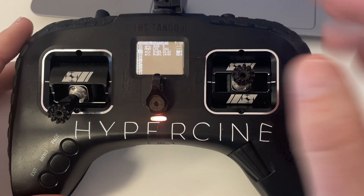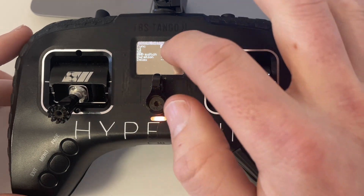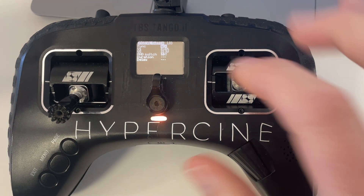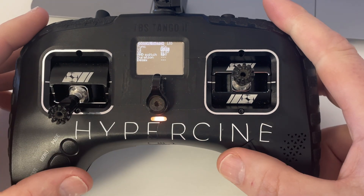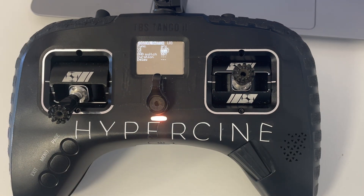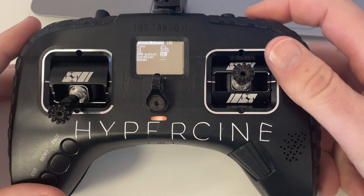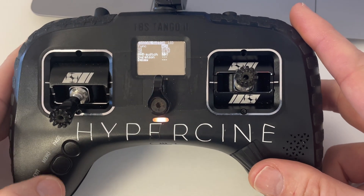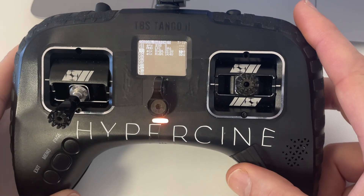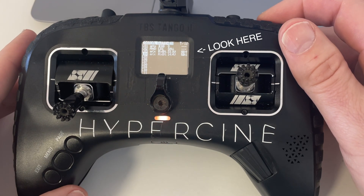To program this, go to L03 and do edit. Here you put: A is less than X, on V2 RXBT — that's the battery coming from telemetry — and then the value you want. I put 22.1. You can put lower or higher, whatever you think is right. I know that when I'm giving full throttle for 3 or 4 seconds it's going to beep — yes it will — but as soon as you go into a hover, you'll hear it's not beeping anymore, which is fine. Then choose which switch you want to use. I'll exit here, and then I'll do the same thing for L04 but I'll put 14.4 and have the button SD down.